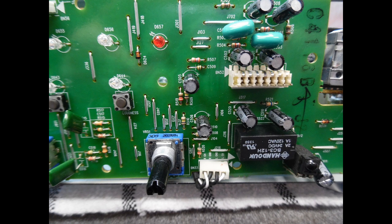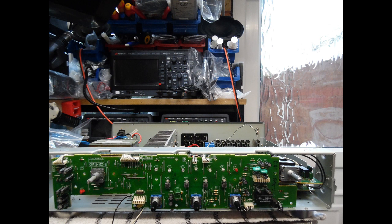There's quite a bit of strip-down required to access the front panel board. You remove the front bezel — which contains the board — unscrewing multiple fixing screws at the rear after unplugging the volume control board. You also need to release the locking nut holding the input selection encoder, unscrew the power plug fixings, and release the headphone socket before you can pull the board away.